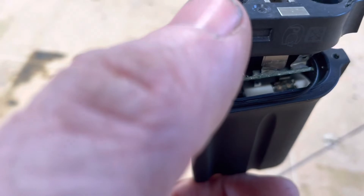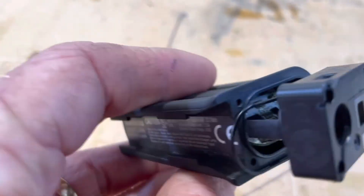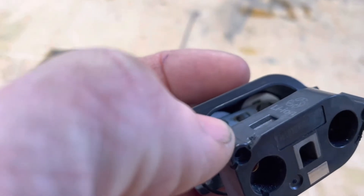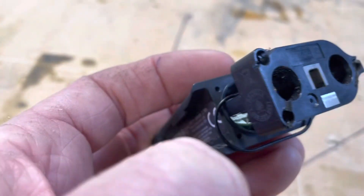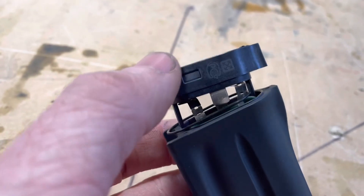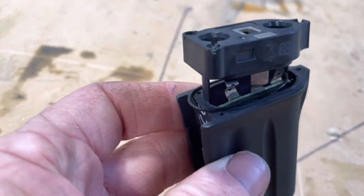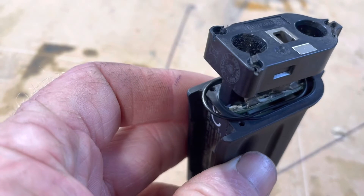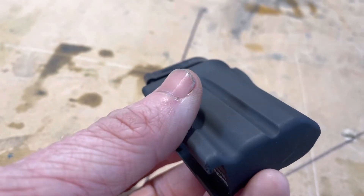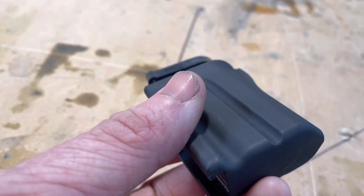At the moment I'm having trouble actually getting that battery out — it's just not budging. I've tried putting a piece of metal down there and trying to lift it out from underneath, but that hasn't worked. So the next step will be to take these soldering tabs off to give me more space, so I can try pulling it from the top. If that doesn't work, the next option will be to drill a hole underneath where the battery is and push it out from underneath.